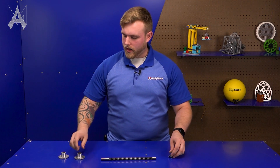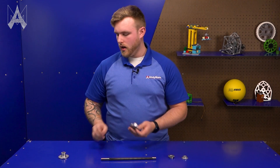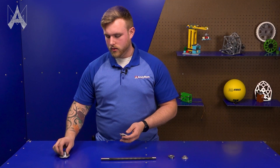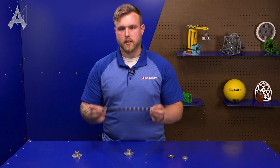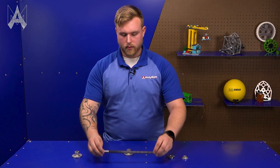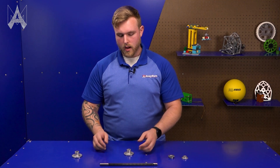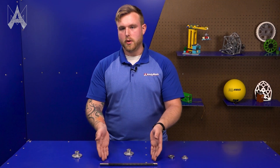In other cases, with certain hubs, we cannot physically broach them because it is too much depth to broach. This is where we start using push broaches. For teams and other people that would like to do broaching on their own, we recommend push broaching, as CNC equipment is not readily available to everyone.